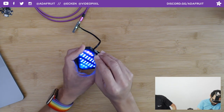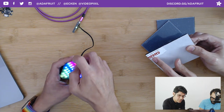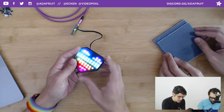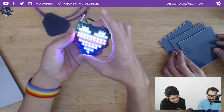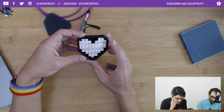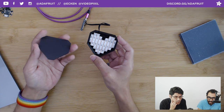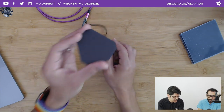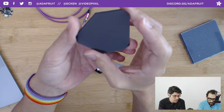We also have sheets over here — you can tell them how you want them cut and they can come pre-cut. Here's the Chemcast cast — it's got the protective covering on it. I cut it on the Bantam Tools, formerly Other Mill, with an eighth-inch end mill, up-cut single flute. Here's what this little NeoPixel strip grid looks like — it's an 8x9 grid with high-density mini skinny NeoPixels all nicely soldered on the back. This was milled on the Other Mill. The top side has a frosted matte textured surface, and the bottom is glossy and smooth — they look different on each side. When milling, you want your adhesive tape on the glossy side.